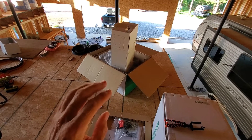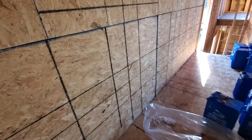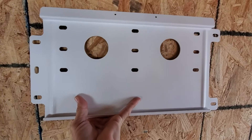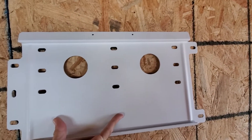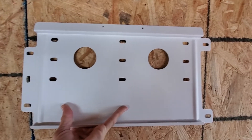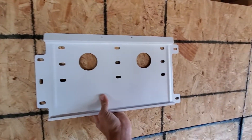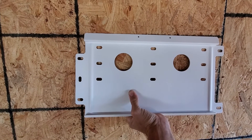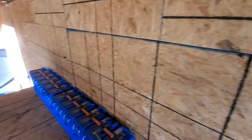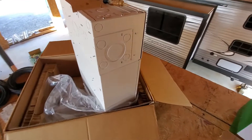I'm thinking it's a lot heavier than 150 pounds. When lifting it out of the box it slipped and my hand raked along the side and busted my nail, so I'm trying not to get blood all over my nice white equipment. These outer holes are spaced at 16 inches, so I've got a stud — everything stacked so I've got studs underneath my floor joists — perfectly at 16 inches. On the left-hand side there's a groove like a Lego piece that fits into the right-hand side, so when I hang the next inverter the next one will fit right up next to it.